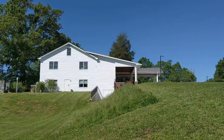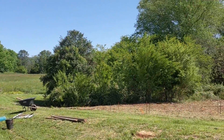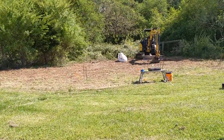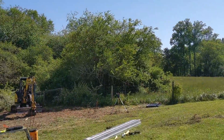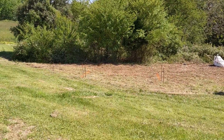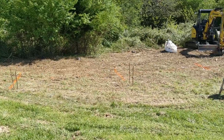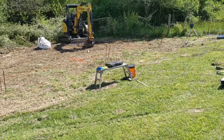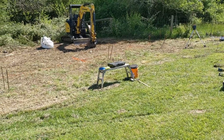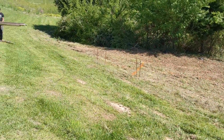We just got to a new site — we're at a Presbyterian Church in Georgia and we are starting to build a ground mount. I'm going to put in a grid-tie system for the church, working with Johnny Boy on this one. We're in what he calls God's country, putting in a 28-panel 10kW ground mount. The site is cleared and marked out, concrete coming at two, and we hope to have the posts driven by noon — so 10kW in a day.